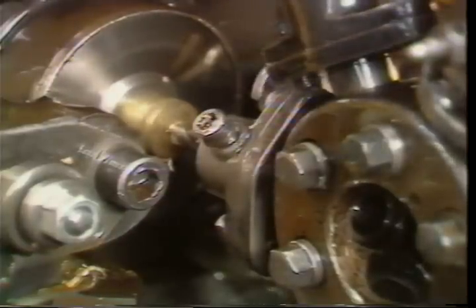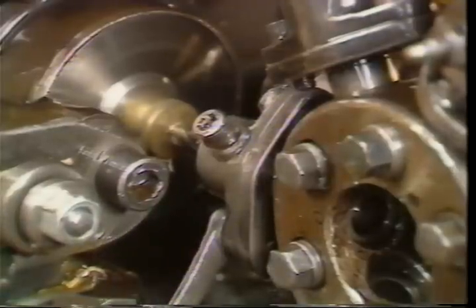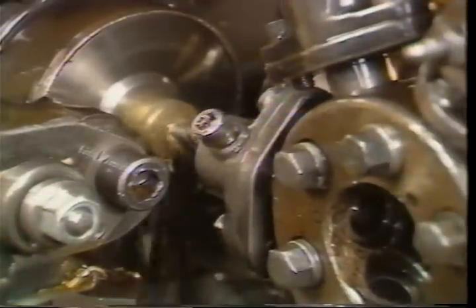The pressure applied by the cutting edges of the drill will center it in the bar stock. Once the locking screws are fully tightened, advance the drill into the bar to the required depth of the hole.